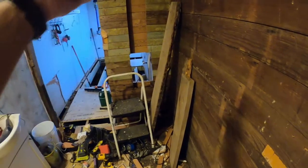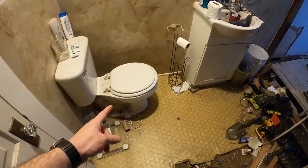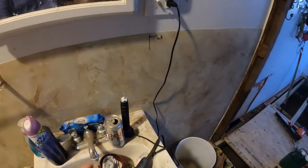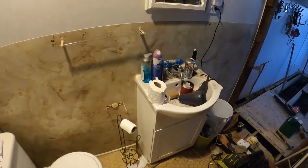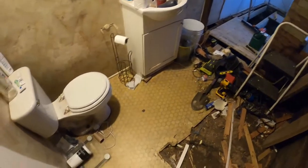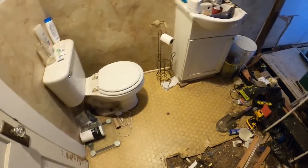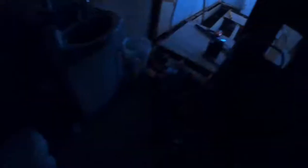The new layout: the tub will be across the back wall, closed off and tiled up. I'll have to build a half-wall in there — I might build shelves into it from the shower side. The vanity will be here at 30 inches, you can see where that goes on the wall, the tub comes out to here, and that gives about 36 inches for the toilet. It'll be a standard modern bathroom — you come in the door, walkway, tub there, toilet next to the tub, vanity when you first come in.